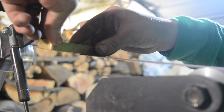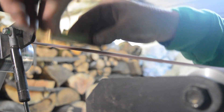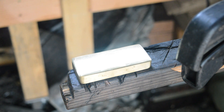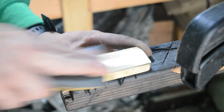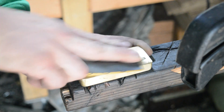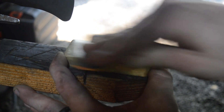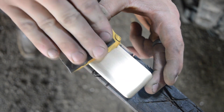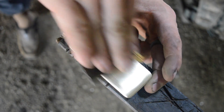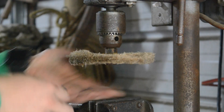Then the face of the bar I'll hand sand all the way up to a nice mirror polish — starting with 800 grit and going all the way up to 1,200 grit, then steel wool, and then buff it out. Of all the film I took of hand sanding, it only took probably five minutes maximum — it's super fast and easy because brass is a super soft metal.